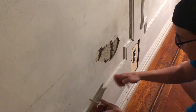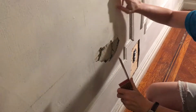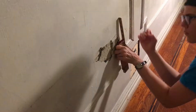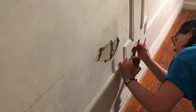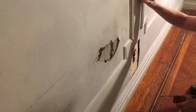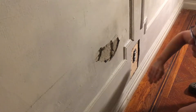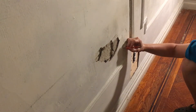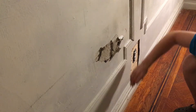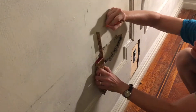The first step in the Plaster Magic system is to measure out where your laths are inside the wall. They're about three and a half inches apart. I'm picking where a lath is based on what I can see through the hole in the plaster and then trying to measure out for new little holes that I'm going to drill. I've never used the Plaster Magic system before this.